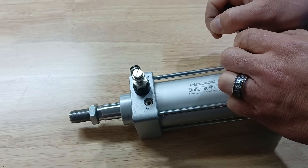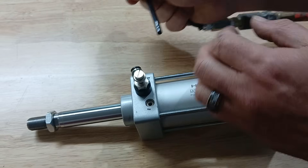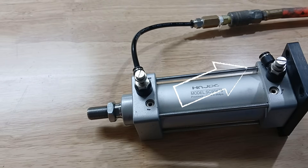There are two configurations: meter out and meter in. Let's start with meter in — we don't want to do this. What happens is we meter the amount of flow coming from our air compressor into the cylinder. By metering in, we cause problems because friction is not accounted for. Air will come in, compress, build up enough force to overcome the friction, then expand, then the pressure drops, more air has to come in, and we get jumping. However, if we use metering out, we put a flow control valve coming out of the cylinder at the barrel end, apply full pressure to the rod end, and the pressure compensates for friction a lot better. That allows us to evenly stroke the cylinder as you see here.